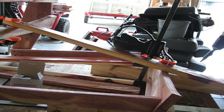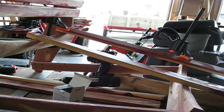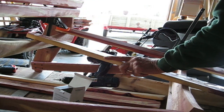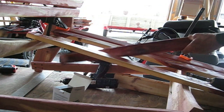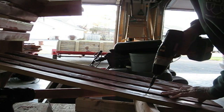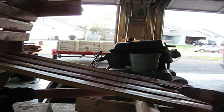The next step is to secure the middle back slat and have it centered so that the others can be spaced appropriately to the side. We secure the side slat, then put the next two slats in place to get them positioned correctly. We fill in the other two slats and secure them with one screw for now, then come back and put another one in later. Then we move to the other side and repeat the process.